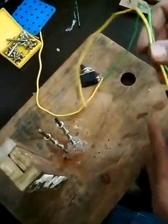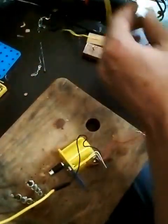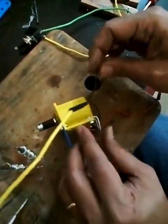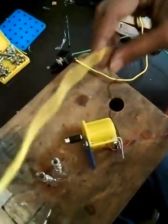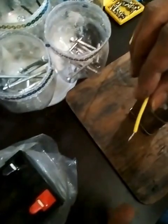I have already attached an on/off switch to the motor. What you do is attach one point of the switch to the motor. The red wire is the positive node, the black one is the negative. I've given the negative wire an extension — I'll put the negative into the negative of the battery. This is a 12-volt battery; you can get smaller batteries, but when you use it for drilling, smaller batteries won't give you enough power.